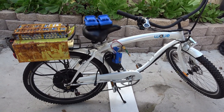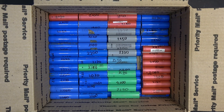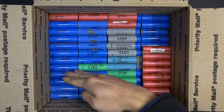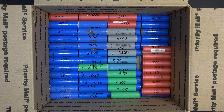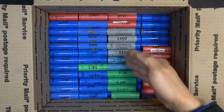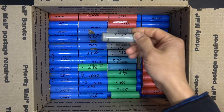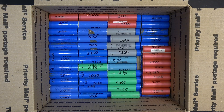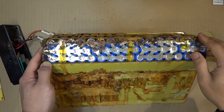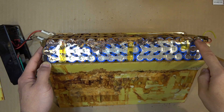Previously my e-bike 48 volt battery was severely damaged by water, but I was able to save about 60 cells out of a total of 91 cells from this battery pack. I need 31 more cells and I got them from old laptop batteries. These are low discharge cells including the blue ones from my previous e-bike battery pack. This is the reason why the original e-bike battery is arranged in a 7P configuration — meaning it has seven cells in parallel — which increases the discharge current by seven times.